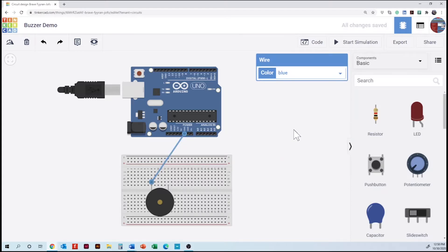Do all piezos have polarity? Not all. There are some companies that are using piezos that are universal and they can be connected either way — five volts or ground. If you get a real piezo, you are going to have to check either the documentation or the top of the piezo, where it has the negative or positive sign marked. So it's important to check the top of the buzzer.